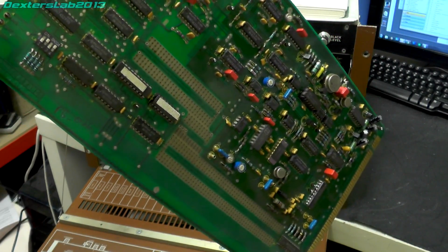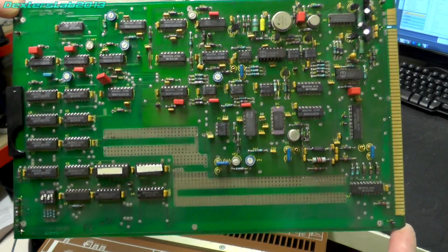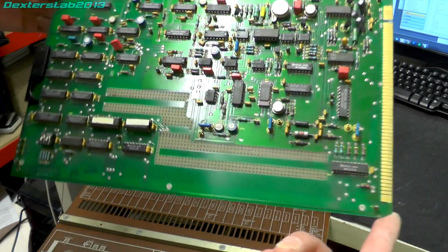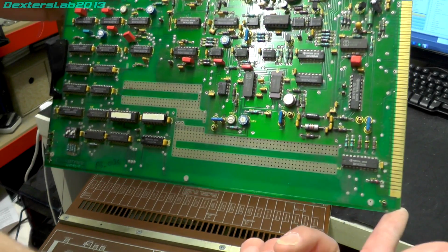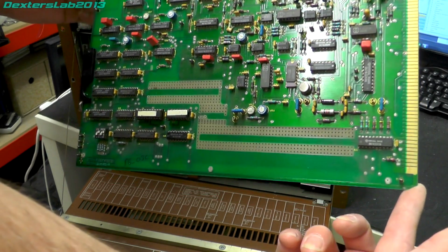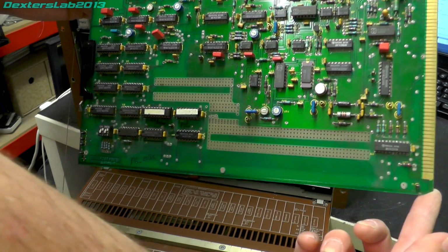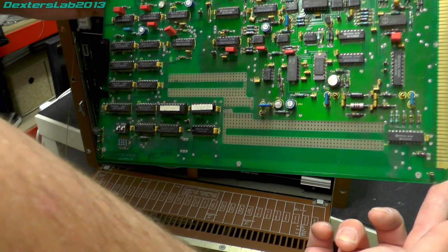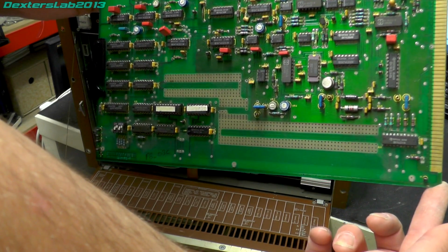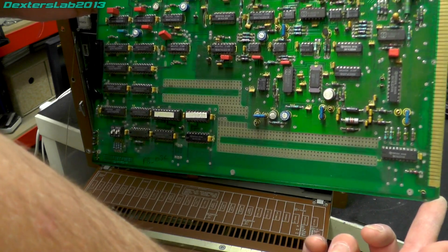So this one is titled Input Locking. Capture the input sync signal and synchronize the rest of the box to it. The introduction says, the input locking card performs 3 functions shown in the block diagram, namely sync separation, video clamping and data reconstructions for the tape interface. The 3 inputs to the card, RGB syncs, composite video and data, are routed to the appropriate parts of the card by the FET switch AG under computer control, and so on.